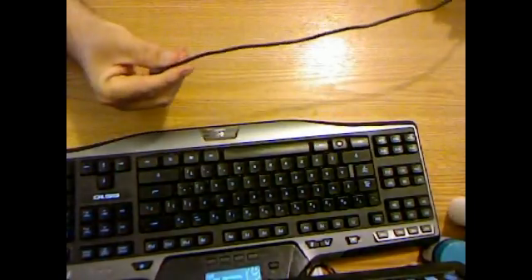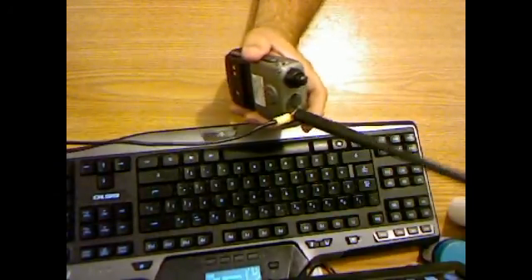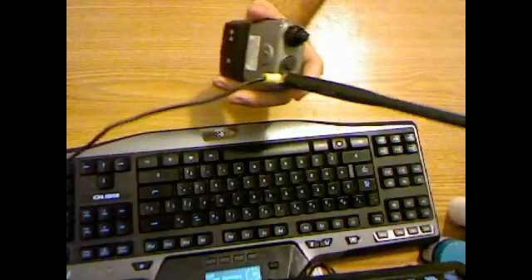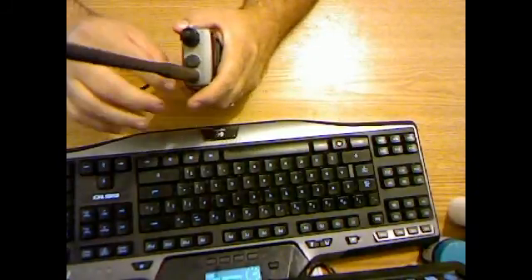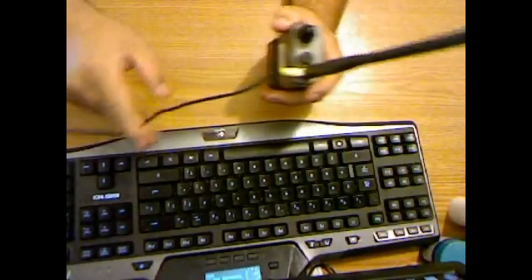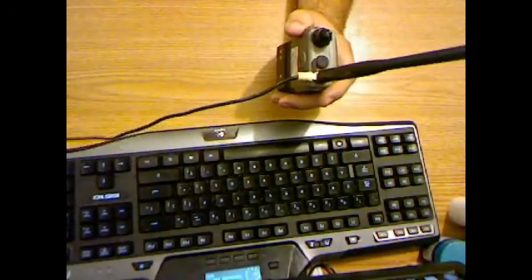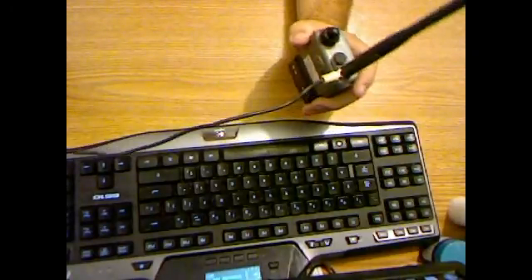You can cut it about six and a half inches if you want to be right on frequency for 70 centimeters. But I just do this length. You can take a power cord — the zip cord — and cut one at twenty and a half inches and one at six and a half inches, then peel the rest off. I pretty much do one for each band.